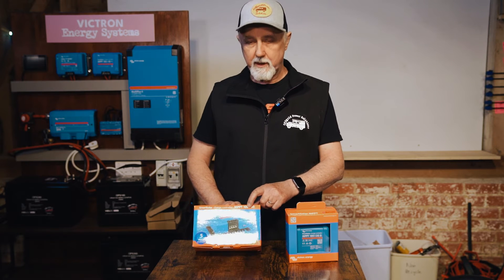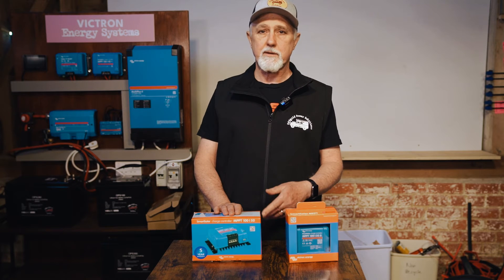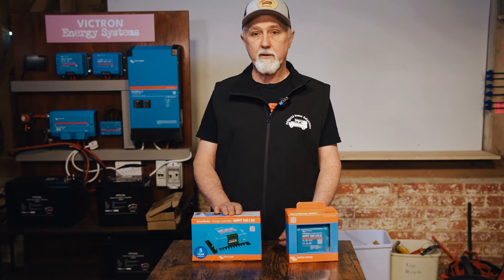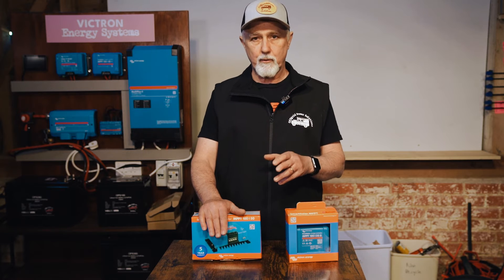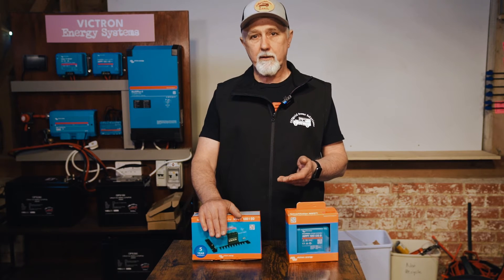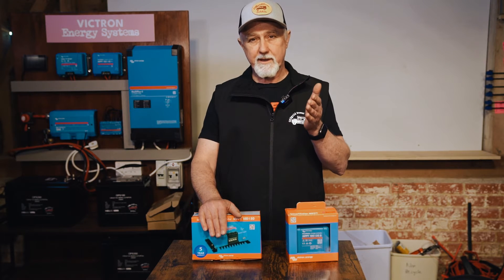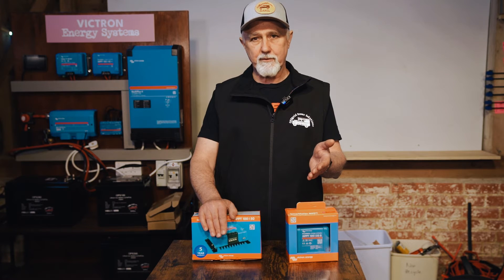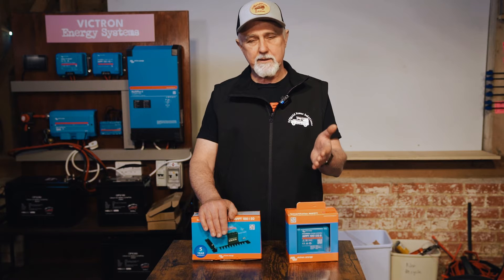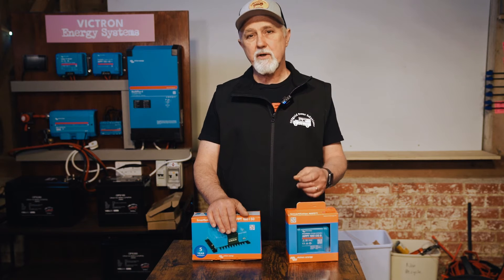This voltage is known as the VOC — the open circuit voltage of your panels — and every panel has its own VOC, which you'll need to check, probably on the label at the back of the panel. If you're running your rig on a very cold morning, parked at quite an angle so the panels are facing the sun, with bright sunshine, that panel is going to be in near-ideal conditions and the voltage may increase above the stated VOC. In that situation you could fry the controller.